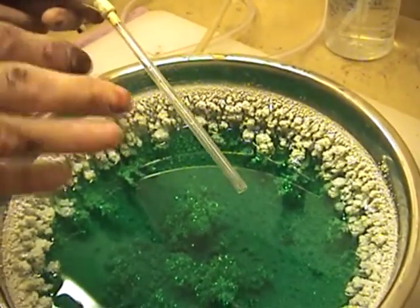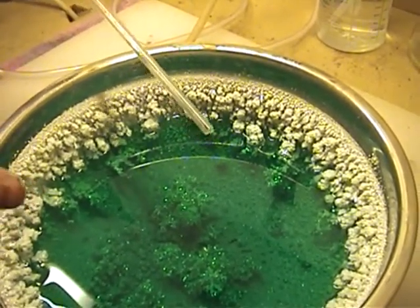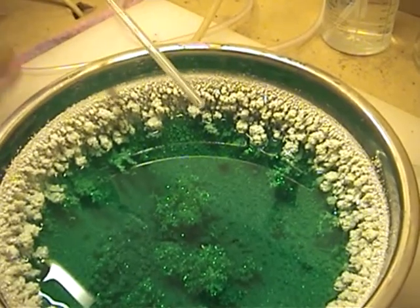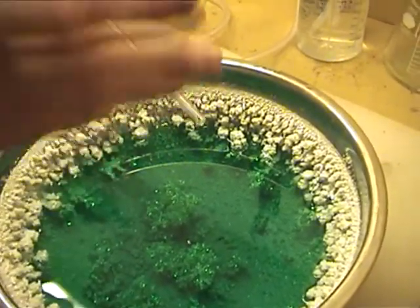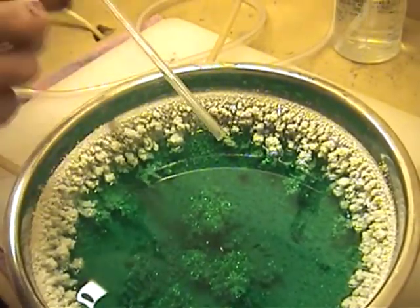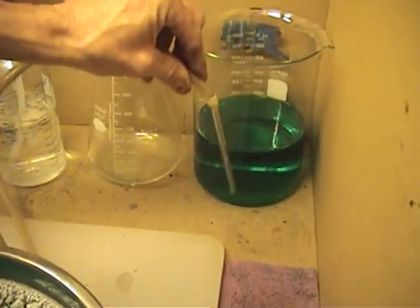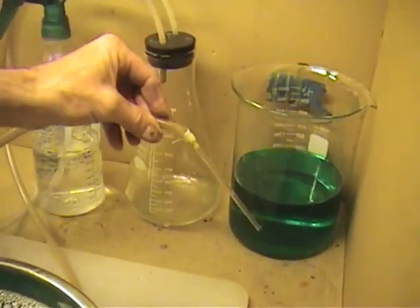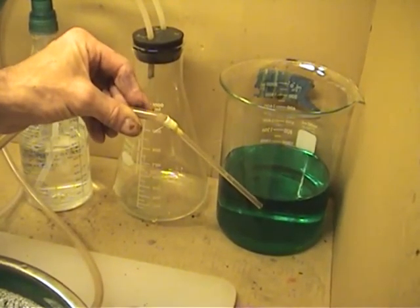I'm a gold refiner also. Whenever you go to decant a solution, you'll let it settle for about 24 hours so all the heavy particulate falls out. When you go to decant, if you try to pour the top off a lot of times you'll stir up sediment in the bottom. You'll get that caught in your filter paper and it will lead to nightmares for filtering. You can use this same trick for decanting out of a beaker — I could stick this down in the beaker so far and withdraw just about the last little drop of liquid, leaving the sediment in the bottom. You could then take that liquid and pour it through your Buchner funnel and it will travel through fast.